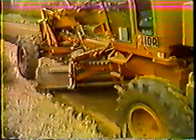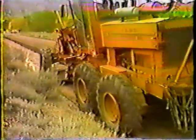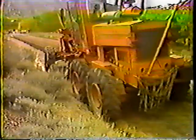Here again, don't do anything more than clean the borrow pit. Apply slight downward pressure and position the blade to leave a windrow at the edge of the road. Now with both borrow pits and the entire road graded, you're ready to pull the material back across the road.